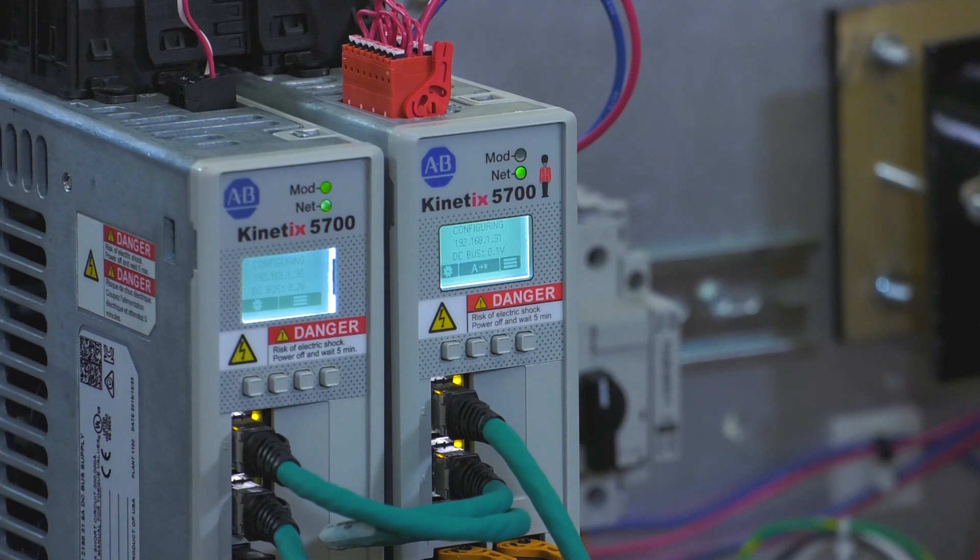The last step is to put the correct firmware revision in the drive. In this case, I'm going to leave it at the newest firmware revision that came with the drive, and simply update that in my program. It is very important to note that if you have a series A drive and you're replacing it with a series B drive, the firmware revisions do not overlap. You simply need to pick the correct firmware revision you're comfortable with and update it in the program.